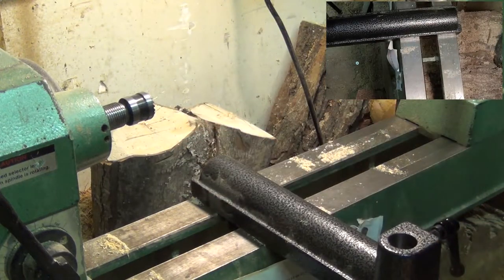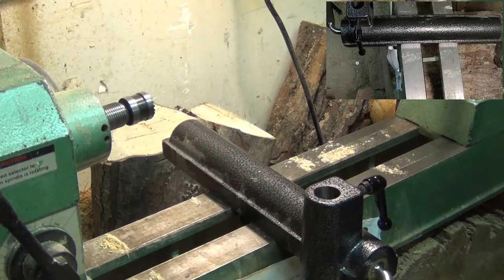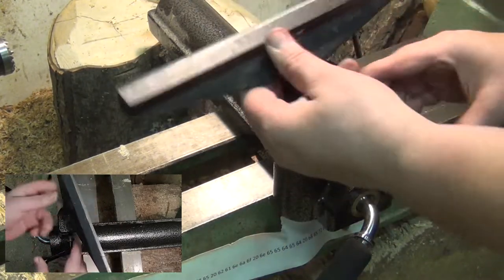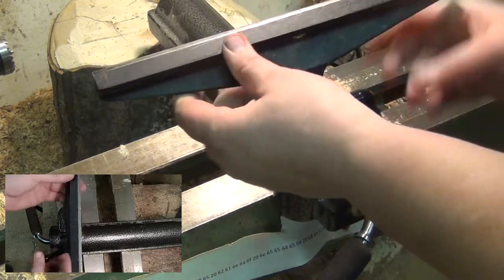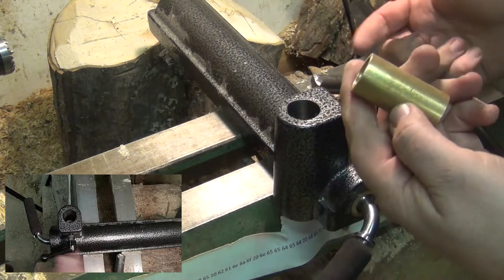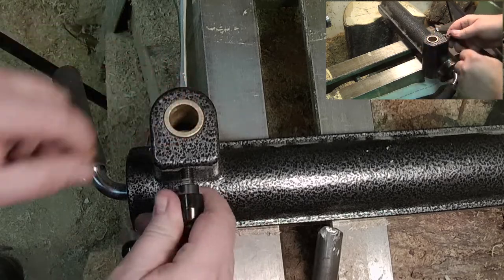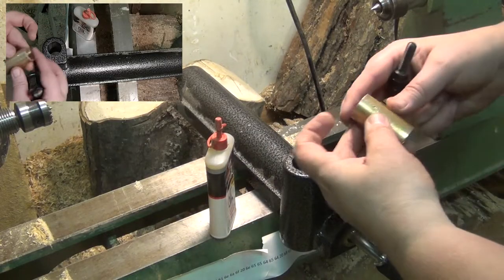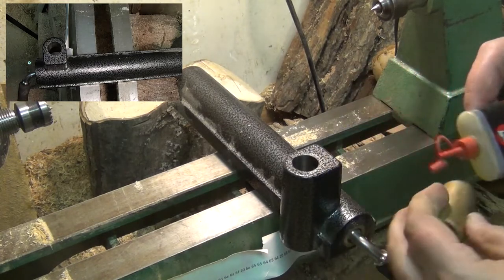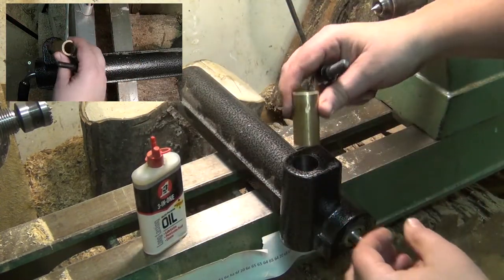I was ready to test the new banjo, then found out two things: that the Scout banjo does not use the same clamping system as the other Robust lathes, and that my tool rest posts were too small. I was disappointed to find out that the Scout banjo used the same clamping system as my Grizzly, albeit with a metal handle instead of plastic. My son suggested that I use a brass coupler as a sleeve for the tool rest post. We used the tool rest locking hole to mark on the brass spacer where we needed to drill the hole for the tool rest locking screw to go through.